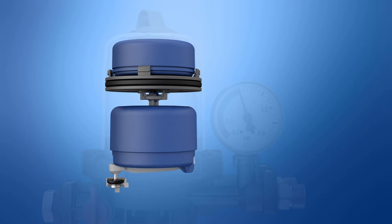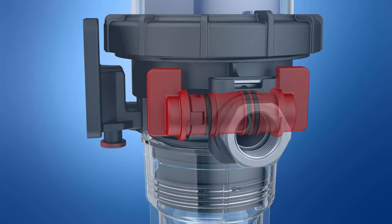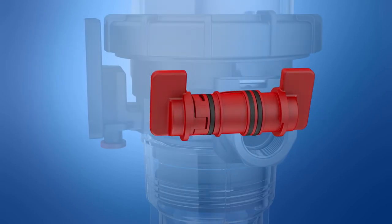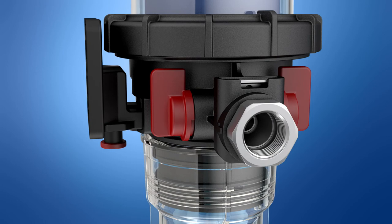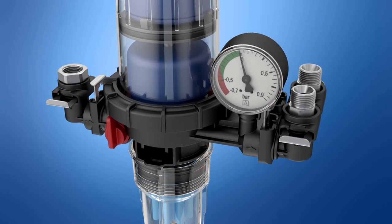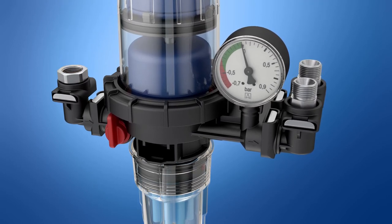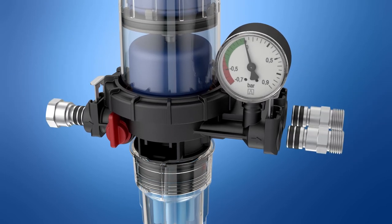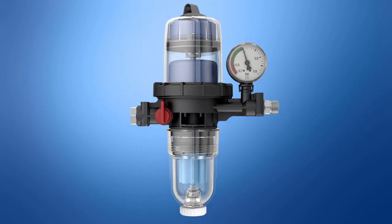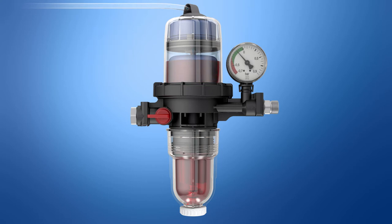The special float safety system is used for de-aeration, reliably keeping oil foam from escaping via the vent opening. The bracket with click mounting system and the shut-off valve that can be operated from both sides facilitates mounting and allows for flexible installation at the left or the right. Accessories such as angular connection pieces provide even more flexibility, letting you directly connect the tank or the burner from above. The vent hose is used for de-aeration so the system remains odor-tight; it is connected to the supply air of the room-air-independent ventilation or the return supply of the tank withdrawal system.